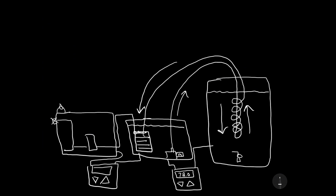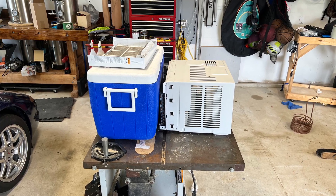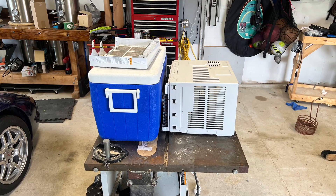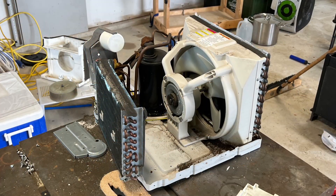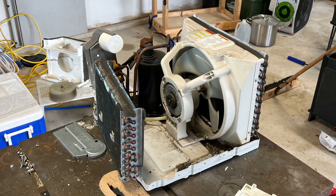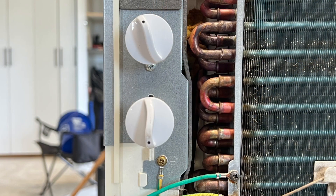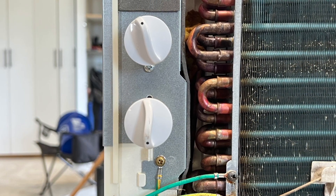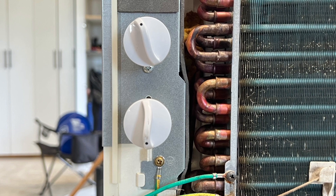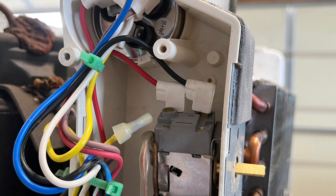The evaporator coil from the AC's refrigeration system will cool the glycol down to freezing or below freezing temperatures. My glycol chiller build started with a $20 AC unit and a retired mash tun. The AC unit was stripped down to essential parts, which meant removing the evaporator coil fan and some shrouding. The AC unit is controlled by an Inkbird temperature controller, which allowed me to bypass the AC's built-in temperature controls by hardwiring the thermostat wires together.